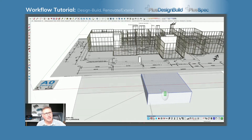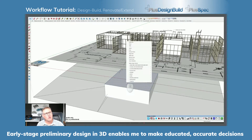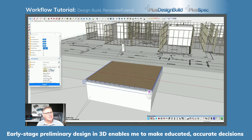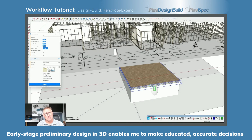From this geometry I can start to create decks, roofs, and everything like that. Your tutorials are inside every tool, but if you right-click on a face or anything you'll notice items come up with a plus in front — so if I wanted a plus window, door, floor joist, ceiling, or whatever, I can just click on that and it will create from that geometry what's required. You can see I'm going to create some joists here and quickly put in my joist direction. It doesn't take long before I can say, okay, if I do a deck there, how am I going to seal underneath — maybe I need to make it out of concrete. It's helping me make decisions as I go.